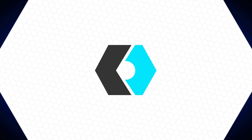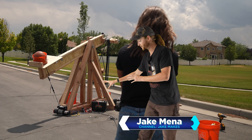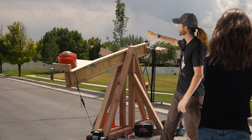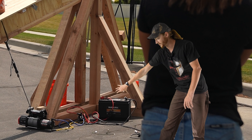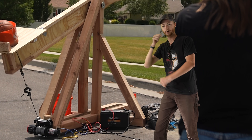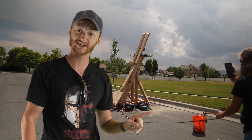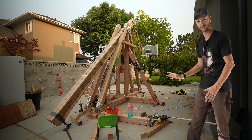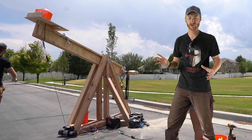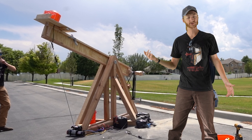Should have seen that coming. Our prototype failed at the very bottom corner where all of the rubber is pulling upwards — it's attached on two points on the top right and down at that corner, and that rubber is basically pulling it straight up and out. The prototype failed because we only screwed it in with two wood screws because I completely forgot to reinforce it. That won't be happening with this full-scale version because we've got bolts everywhere. There are a ton of stress points on a catapult, all of which are potential failures which can cause varying levels of damage to the human projectile.